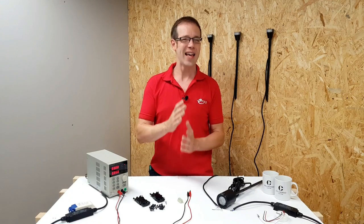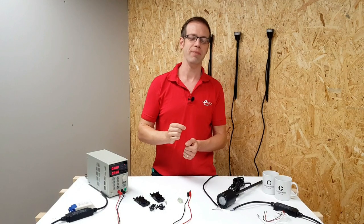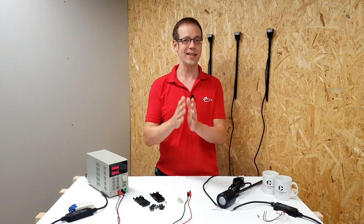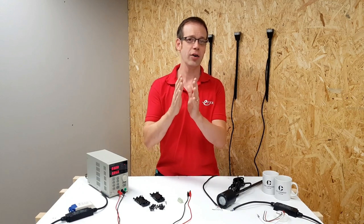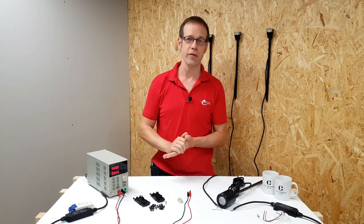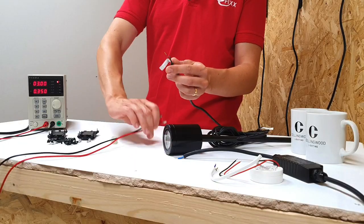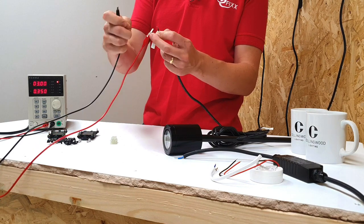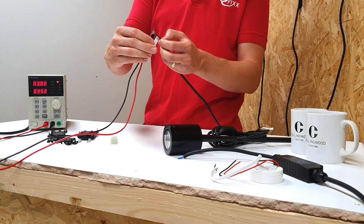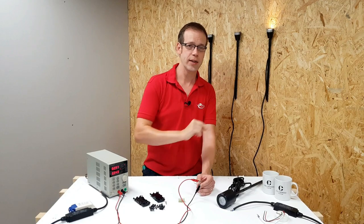The first thing to know is that LEDs are not like the traditional loads we're used to connecting — they're semiconductors. That doesn't mean they're not a very good conductor; it means their electrical qualities change depending on the electricity they're connected to, which I can demonstrate on this LED fitting from Collingwood. I'm going to connect it to this benchtop power supply to inject DC electricity into the fitting and control how much current flows through it. Watch what happens to the current and light output as I reduce the voltage just a little bit.